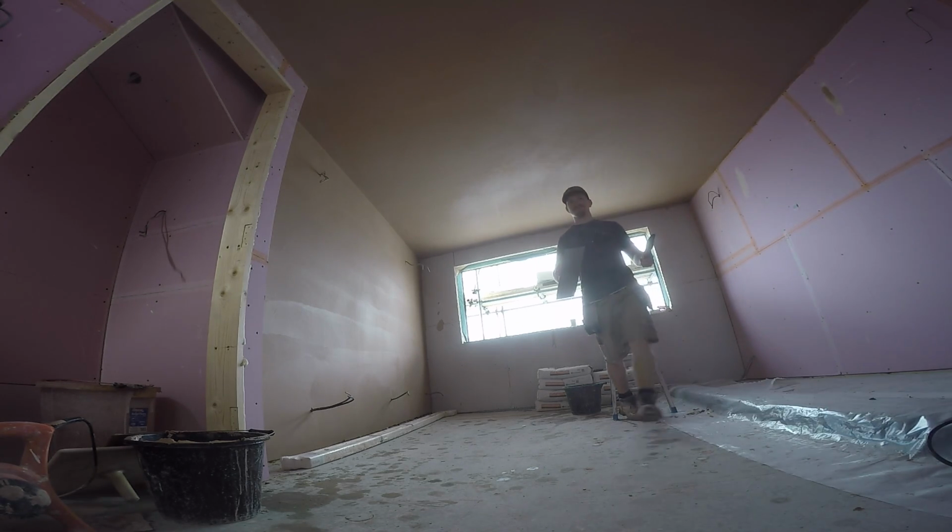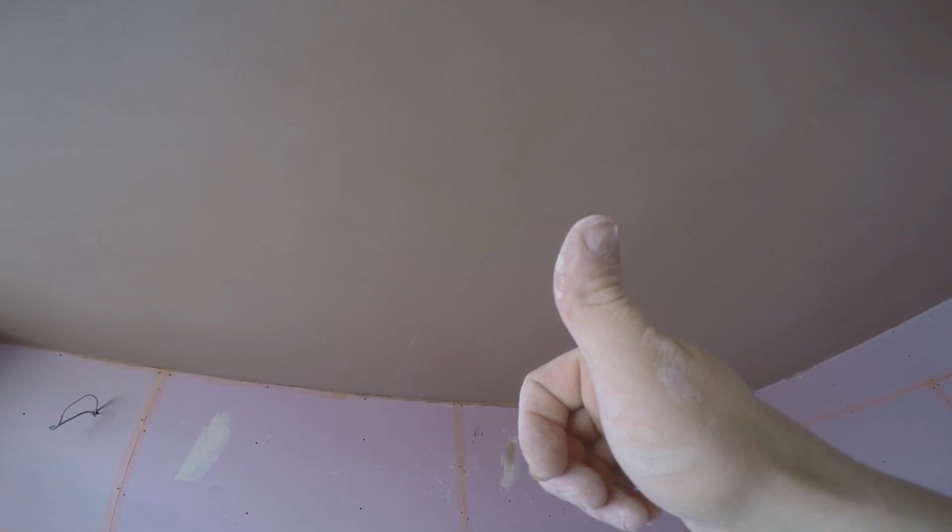Again, it's tricky at first, but as a beginner, you can do it. There you go, nice consistency, nice even finish. Yeah, that's it. The wall there, I'll show you how to do angles to angles at another stage, but for now it was just the ceiling. So that's it. Plain grey finished at 2 hours 28 minutes, and it's plastering for beginners.